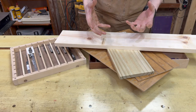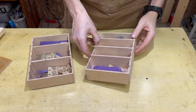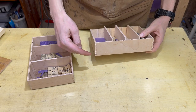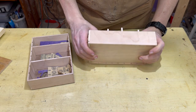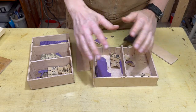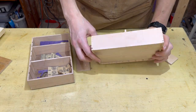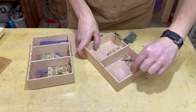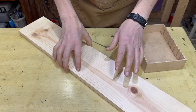If you're looking for really beautiful high-end shop storage, this one isn't for you. This is not going to have any hidden beautiful joinery — we're essentially going to be finger jointing these. We're going to be putting a bottom groove in there and making divider slots, and as you can see these are all visible. These are purely for shop storage. The only thing we're going to change is we're going to add a groove to the top and then cut this down a little bit so that a lid can slide in and out.